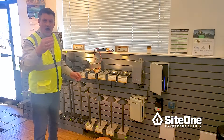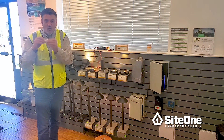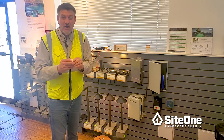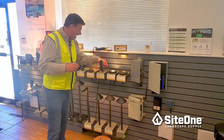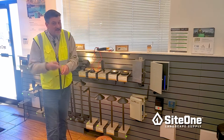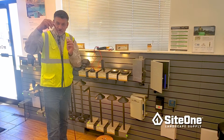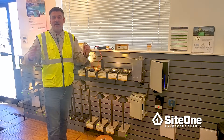To figure out how many lamps we can put on that wire, first determine how many volt amps each lamp is using. For example, if this lamp right here is 4.6 volt amps and I know I can put 240 volt amps on this 12-gauge wire — each wire size has its maximum — I would divide 240 by 4.6, and that tells me how many I can put on.